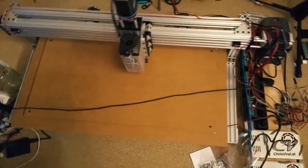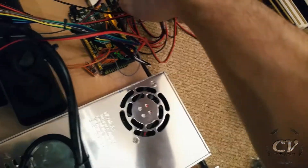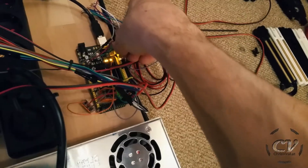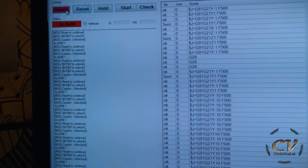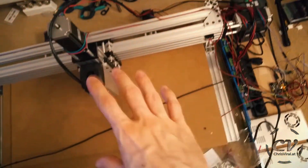So let's move it back to zero. To demonstrate — they aren't plugged in right now, and I'll get to why in a second. These are the pins, taped together so it's easier to remove and plug back in. Check this out: the screen is idle. Let's click this one for the X axis — alarm, reset, unlock. The other one — alarm, reset, unlock. Let's click this one — reset, unlock. And this one down here — working as expected. And the last one — reset, unlock. As you can see, it's wired up properly. All of them are working.